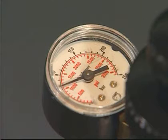If you turn it too far, the valve may be damaged. Read the pressure gauge and compare with the desired or maximum pressure. Remember that the gas spring may have been adjusted to a different charging pressure than the MAX.